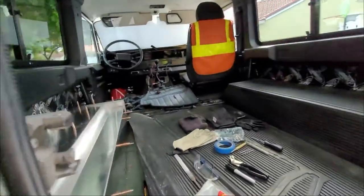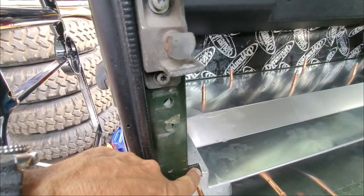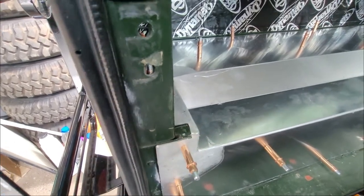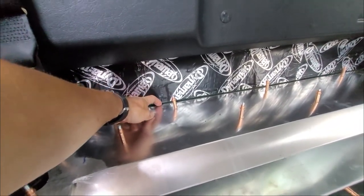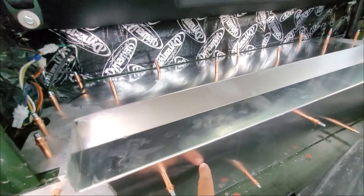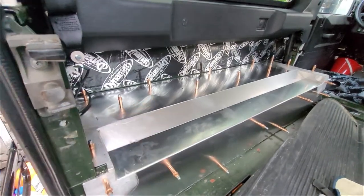For instance, they said 185 millimeters from the back wall, and I ended up right on the edge, so on this side I'll mark 187 just to make sure that piece of metal tucks underneath the lip of the top sheet of aluminum. It said 195 millimeters from here to here, so I went 200 to make the cut a little smaller. From the bottom up it said 180 and I went 185. I may have to recut — no problem, and I'll let you know during the video so the hole will be more exact.